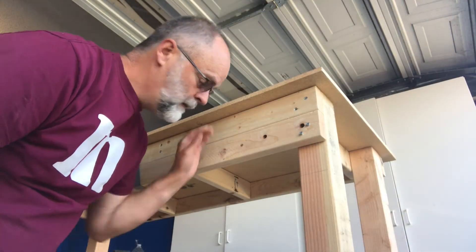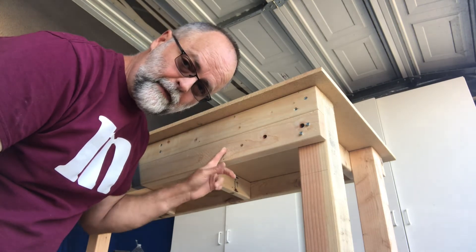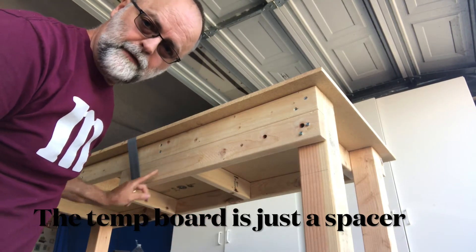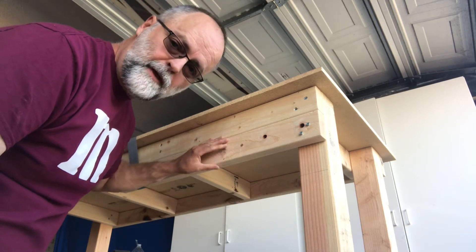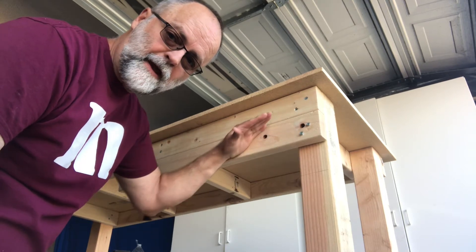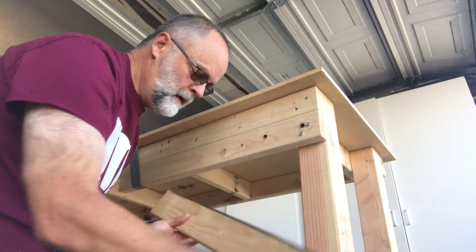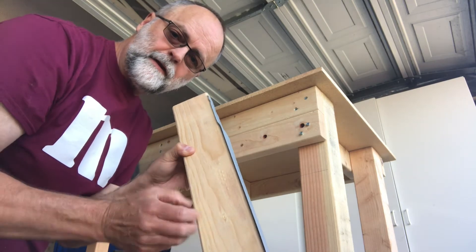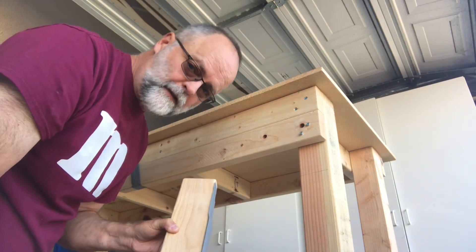Here's what I'm doing. This is the frame — this top board here for the bench is a temporary board, only in here temporarily and I'm going to take it out. I have tape over here because even though I have two screws, this fell down a little bit so I wanted to make sure it was snug. This piece attached to my extended top is going to slide in and out, and then this is going to hold it in place. I got my thinnest paint stirring stick and taped it on here to give me enough gap so it slides in and out freely but not too loose where it's jiggling around.